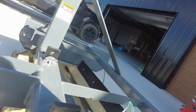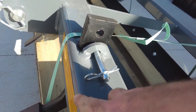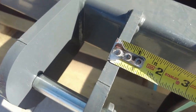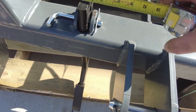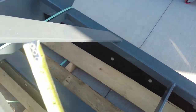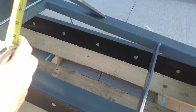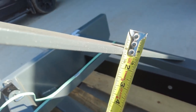Yep, 4 inch by 4 inch. Probably, I can't tell the thickness, but with this radius edge right here, it looks pretty beefy. The 3-point arms, where the 3-point attaches, that's about 1/2 inch right there. Ripper shanks are 3/4 inch. This looks like a 1/4 inch chunk of flat bar here, tying these two together. Looks like there's a piece of steel that connects the 3-point back to this, and that is, we'll call it 5/16. It's pretty beefy.